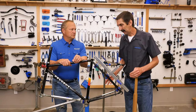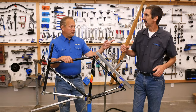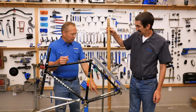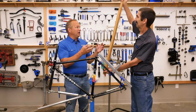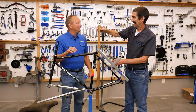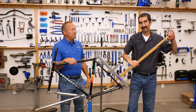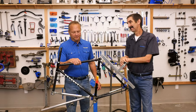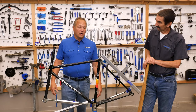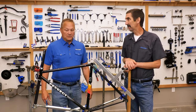The last old tool is the FBT1 — Frame Bending Tool. It's a big stick with a leather-lined hook for the tube so you can lever things open. With five-speed bikes, then modern six-speeds coming along, the rear triangle got a little wider, so some spreading and alignment work was needed. These were made at a local wood shop, with a leather strip glued in, then dipped in a tank of polyurethane. Those are just some of the things we used to make — and don't anymore — for good reason. You've got to learn and change with the times.